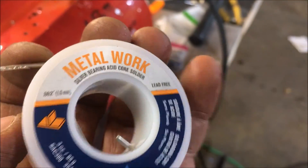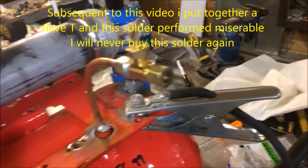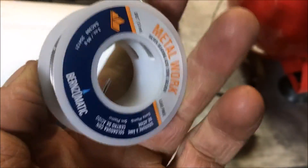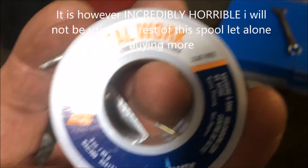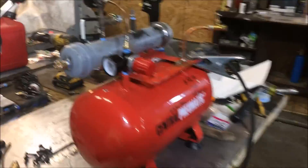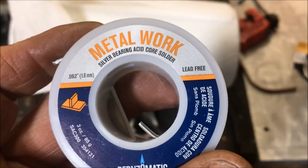You just kind of get a feel for the stuff. This stuff probably won't silver solder metal very well. If it does really well on poorly prepared surfaces, it's going to be a good solder. The Lennox stuff will do that — this Bernzomatic stuff will not. I'm not saying it's the worst solder in the world — it did work. But you just got to really clean the parts. And let's be honest, who has time to do all that sometimes? Especially when you're just building something and you just want to get it together.